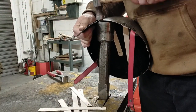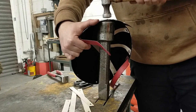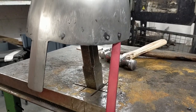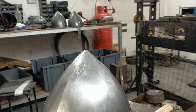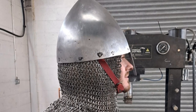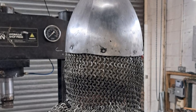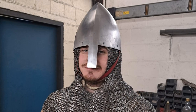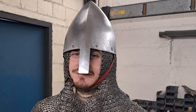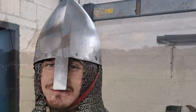The last step is the assembly. We rivet the chin straps to the helmet, followed by the internal liner which we tie together with a simple cord. This is an internal suspension method known as a spider. And there we go — we now have the finished piece. You can use a selection of soft scouring pads and oils to achieve whichever finish you desire. I personally chose a dark satin finish which I believe would have been common for the Norman helmets reserved for the High Lords during this period. If you're interested in purchasing a medieval helmet just like this, I will be hand making them and selling them on behalf of Lancaster Armoury on their website, all links of which will be left in the description below. I will also be making a follow-up video discussing how to achieve historical accuracy to our best efforts when attempting to replicate originals made by real medieval armorsmiths.